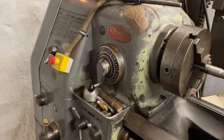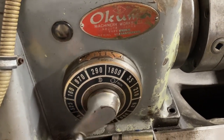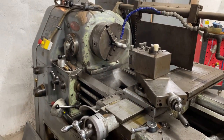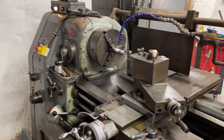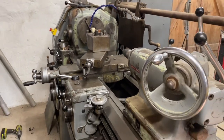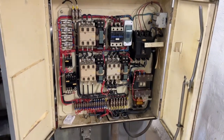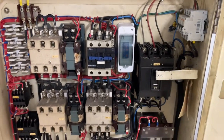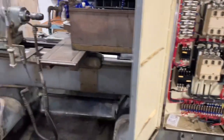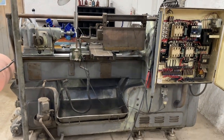What I did was take the highest RPM setting — about 1800 RPM — and started the lathe, counting how long it took to reach full speed. It's really heavy so it takes a long time to start. I counted about four to six seconds, so I set the timer to four seconds and it worked perfectly. If someone has a similar problem on a lathe or another machine and doesn't want to install a VFD, just put in a little timer box like this and it works like a charm. That's all for today — I'll show you more of this lathe later, bye!